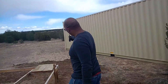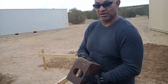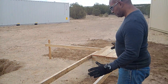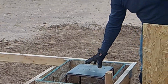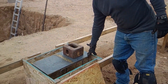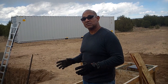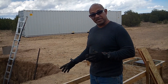Look at the bottom part of the shipping containers — you'll see right where the lip runs, but the ending piece is where all the weight actually is. I have an actual ending piece here. These things are pretty heavy. This will actually fit here on this metal where we set them, so you'll have one there, one on the corner, and the other corner will sit here. Once these set on top of these metal pieces, we'll weld them around the edge. We'll bring a welder out and weld the shipping containers to this metal sheeting, which will be encased in the four-feet-deep cement. That's how the whole foundation for the shipping container will be processed.